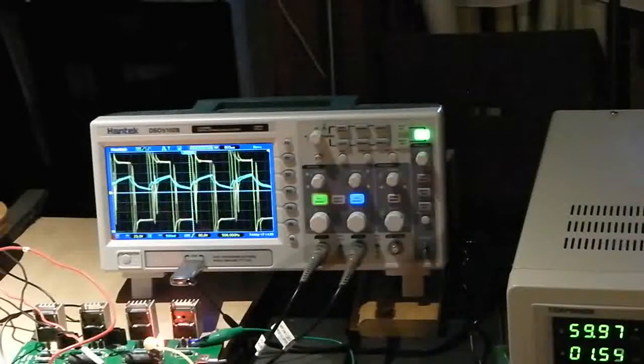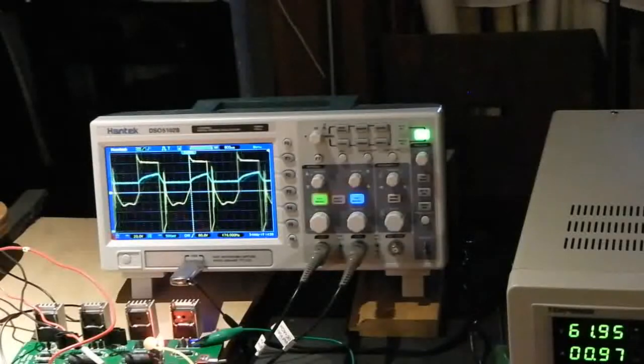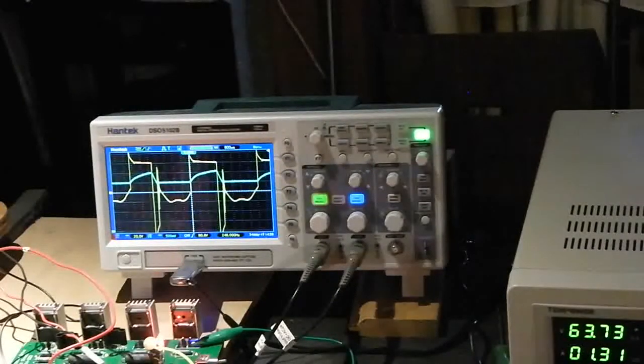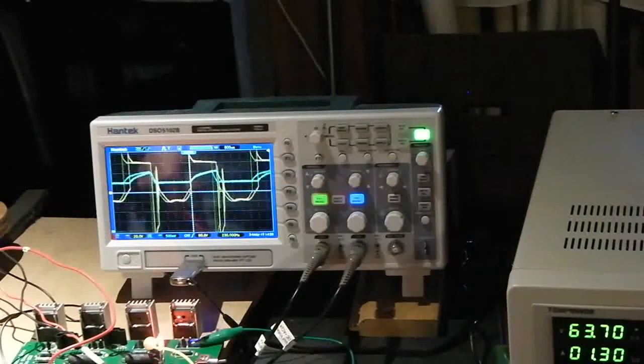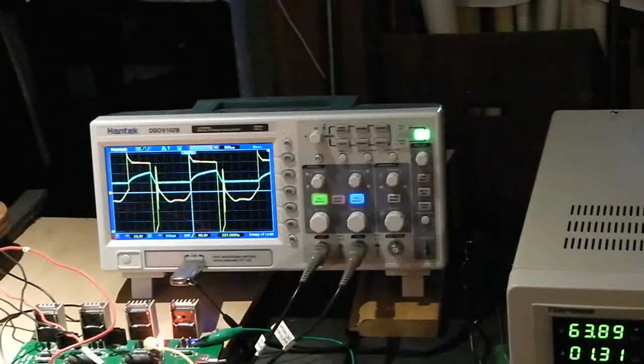Let's just do an interesting little side test, again the acid test. If we disable one piece of the firing circuit, will it continue to run? Let's try it. So, yep, still running, and you will note the back EMF on the circuit that's not firing. This is the induced voltage produced by the rotor working against the coils. Okay, speed it up again.